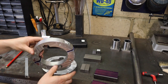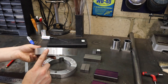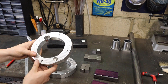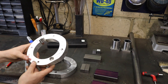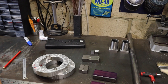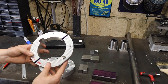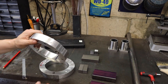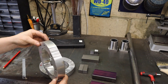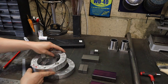I've made these as a two-part clamp that you can do up and clamp tightly onto the column. On here I've got a flat machined face which my extension bar can come out to. These brackets have just been made out of aluminium — fairly easy to do. I've made them out of some existing parts I managed to find on eBay.